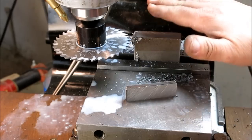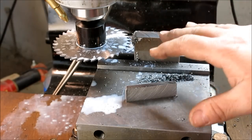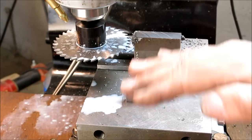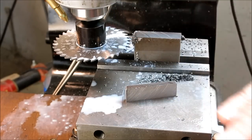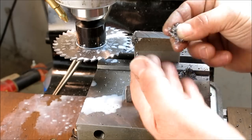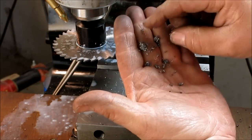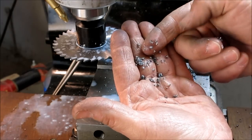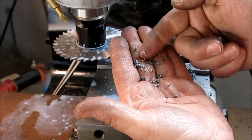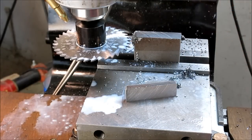Just remember: take your whole thing in one shot. That's probably the single best piece of advice I can give you — whatever you're cutting, if the saw makes it through, do it in one shot. Just feed slower if you're nervous. You can see these chips — there's not much to them and there's plenty of room in the gullets.